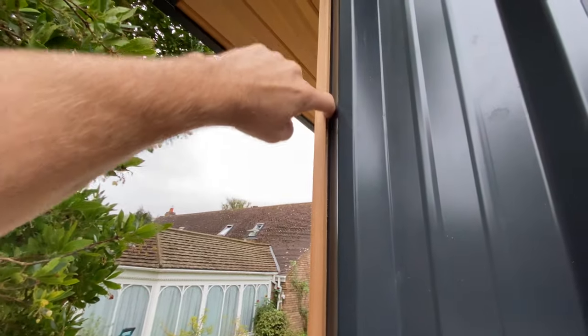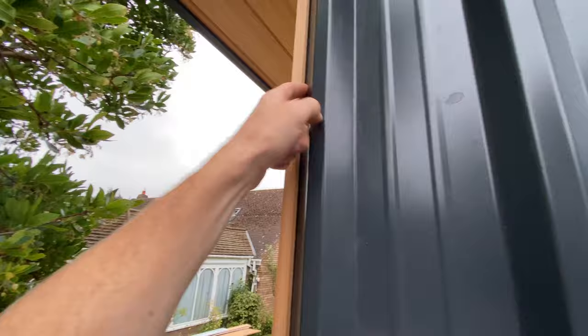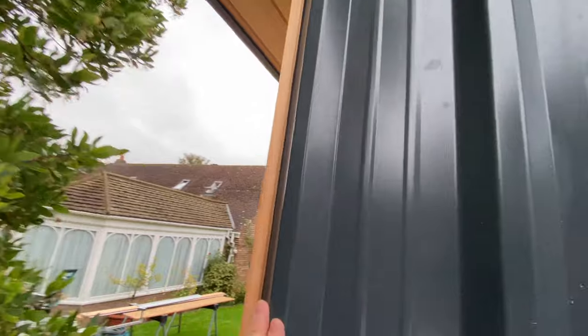As I showed you in a video before, if you've got the box profile sheets your first sheet of cladding is going to go up as so, and then you're going to put a rebate — run a track saw down the back of it to put a notch in it. That way you can put the metal sheets into the cladding and it finishes off lovely. This little tab on the metal sheets is on the end of them and that will slot nicely in there and just stop that from moving around after we've fixed it.